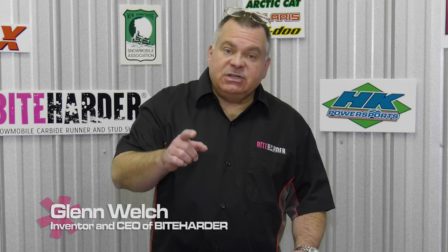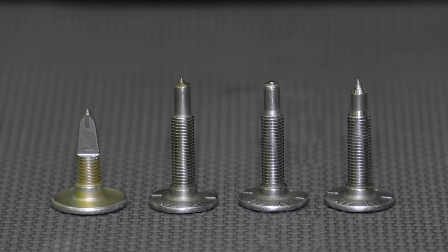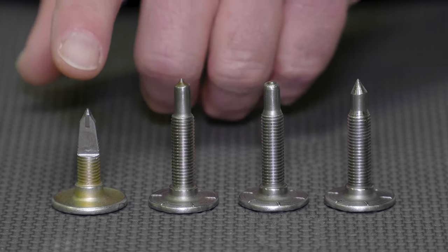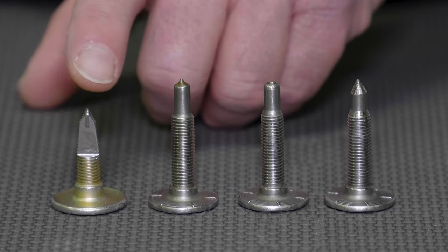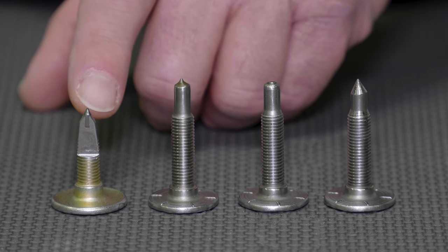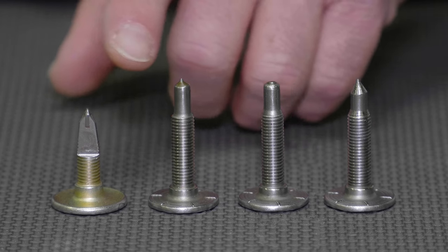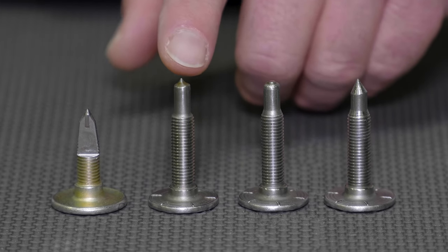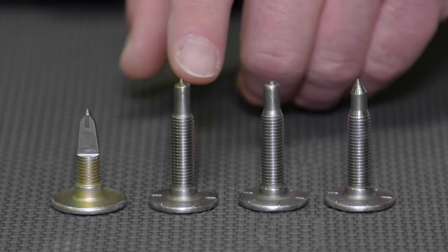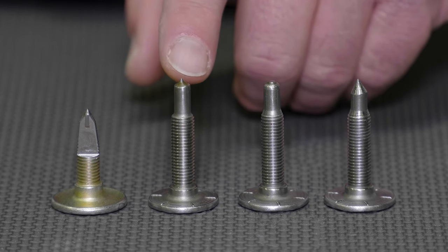Let's take a look at how studs are manufactured and the typical wear process a stud will go through. During the manufacturing process of a carbide stud, a blank is machined and there's a hole left in the top. The carbide is inserted in there and brazed under high heat. You can see that in this stud detail right here where we've machined half of the stud away. You can also see how deep the carbide goes into the stud. The next stud is a brand new stud that will show you the brazed material surrounding the tip of the carbide that is exposed from the body or host material.